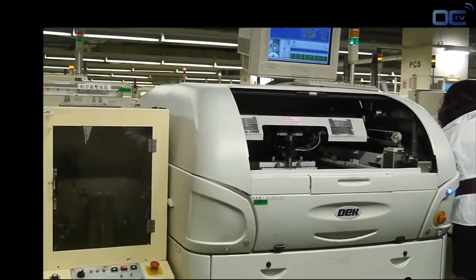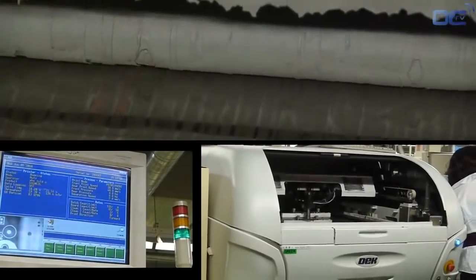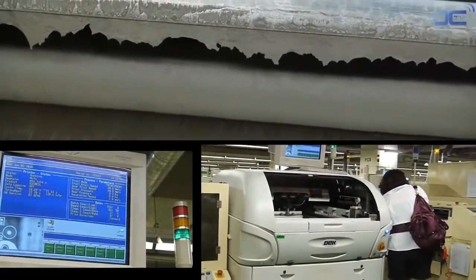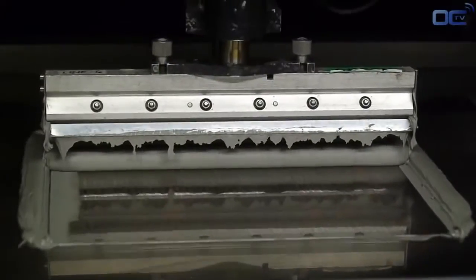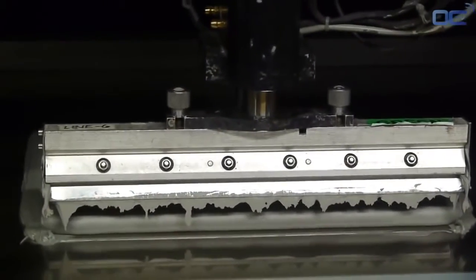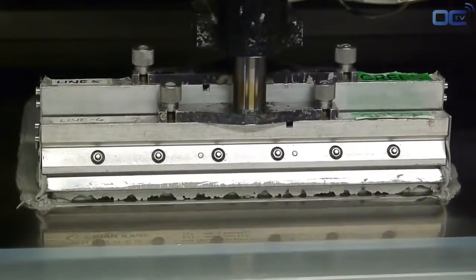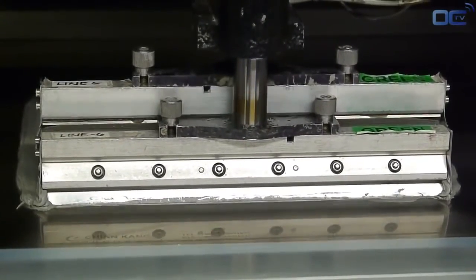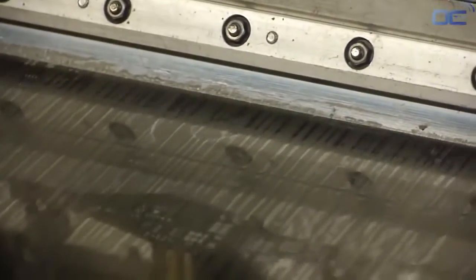Every part of the PCB that will be in electrical contact with a component gets a special solder paste pass. The solder paste acts like glue for all these chips before going to the reflow oven for definitive soldering. In that way, every small component can stay in the right position before soldering. As you can see, solder paste is applied only to the PCB space where you will have a component.